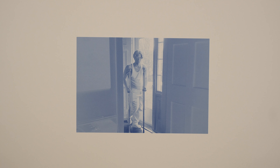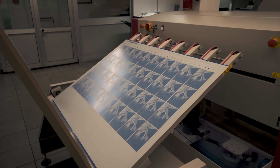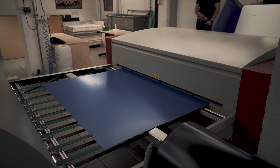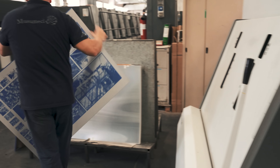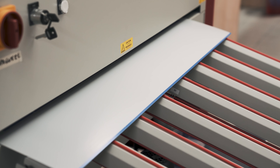Then all the fun stuff begins. The first step in the production is creating the plates. These metal plates are later inserted into the printing press and are used like a stamp with ink to transfer the images onto the paper. For each printed sheet of paper there are four different metal plates to comprise the different colours to make the full image. Plates are made in a specialist machine that uses chemicals to mark the plates, though some places also use laser etching — but the benefit of chemicals is that you can wash off the plates and then reuse them.